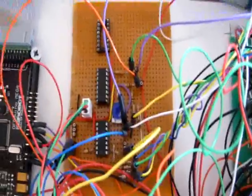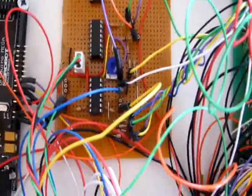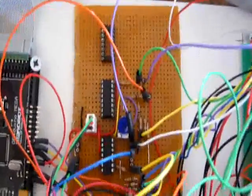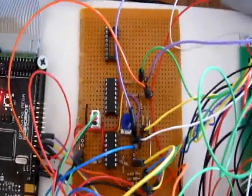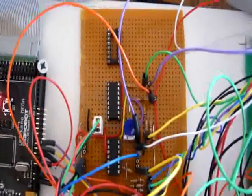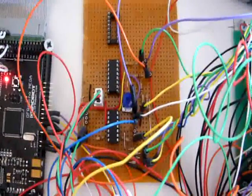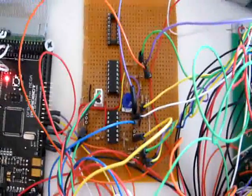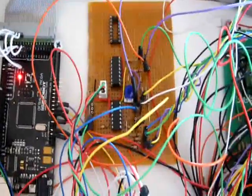We've also got this board, which is a sort of mod board. It's got a mixer at the bottom for the output of the main oscillators, an external input, which is very useful, running stuff through the filters, and also ring modulator for some nice weird clangy sounds, and a comparator which generates PWM, which is a nice addition to the original Fatman sound of just the sawtooth.